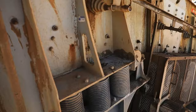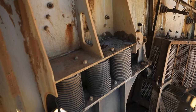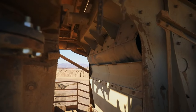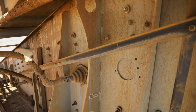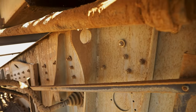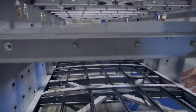This product is similar to what you might see in the industry, but what's different is the construction of that screen. The Anthem screen has got an integrated feed box built into the side plates and body of the screen — it's not a separate attachment. The deck construction itself is very similar to what we use on our Guardian screens or horizontal screens; it's a fabricated I-beam which is very rigid.